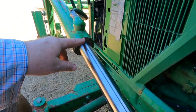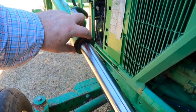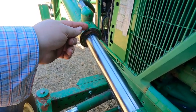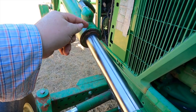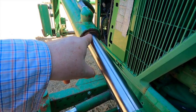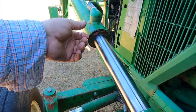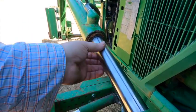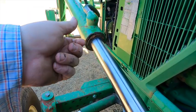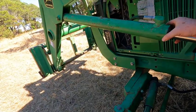There's a bunch of ways to take hydraulic cylinders apart — as many ways as there are engineers thinking of them. Take this one: it's an outside snap ring. You put your snap ring pliers in here, expand the snap ring and it comes off. Then you'll find an internal snap ring inside the bore. Pull the outside snap ring, drive the gland into the bore far enough to reach the internal snap ring, pop it out, then snatch on this rod so the piston hits the gland and drives everything out.